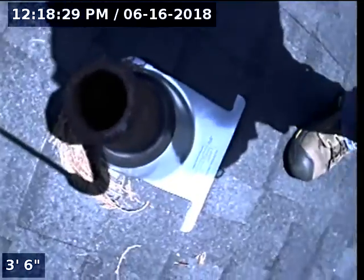Hello, this is Seth Lewis from Lantern Home Inspections, here to perform a sewer line camera inspection on property 14907 Southeast Cronberg Avenue, Milwaukee, Oregon 97267. Current time is 12:18 p.m. on June 16th, 2018. The house is facing northwest. I'm here on the southeast side of the roof where I've located a 3-inch cast-iron plumbing vent stack. This is where I'm going to access. There was no access around the house or inside, so I'm going to try to go through this area. The purpose of this inspection is to determine the overall condition of the sewer lateral for this property.